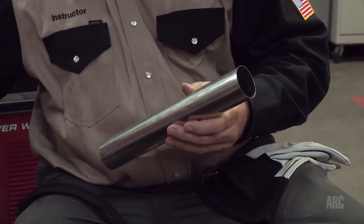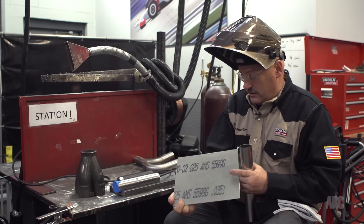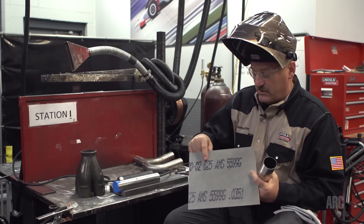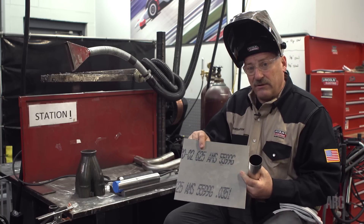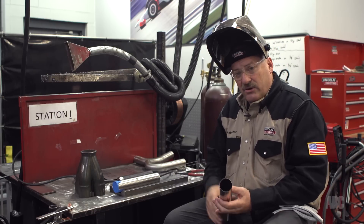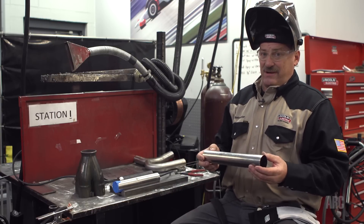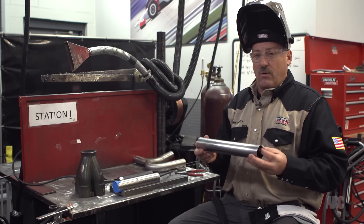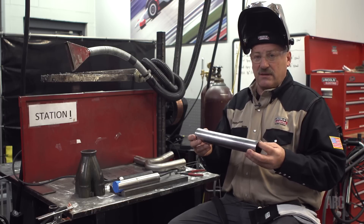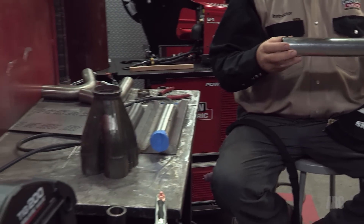They start out with sheet and the sheet sometimes has some numbers on there. In this case you can see there's an aerospace material specification here and there's also the 625 for the nickel alloy we're working with. These parts can quite often be quite thin. The idea of using them and the reason they're paying the extra money for this expensive material is that they can cut the wall thickness in half. Headers can be as thin as 19 thousandths; 28 thousandths is pretty common and even 35 thousandths. The part I'm welding today is going to be 28 thousandths thick.